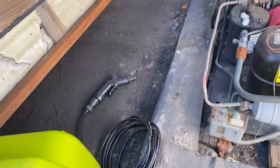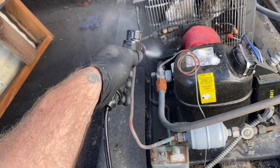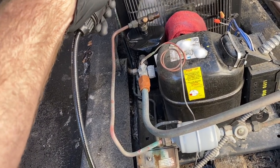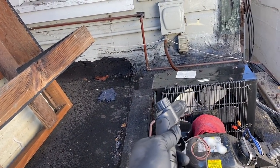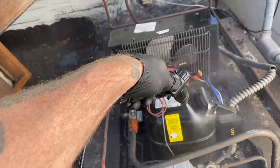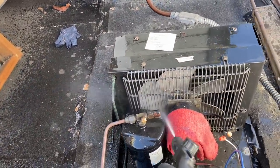Ready to rumble. Are you ready to rock and roll, baby? Wash that receiver off. The fan blade was super dirty and the grill is your air out, so you want that to be clean too — the fan guard. This is a bit dirty. I wanted to get that washed off too, then we can read the label real good. See that fan blade got cleaned up just that quick. Now we're going to wash this coil out.